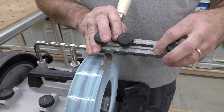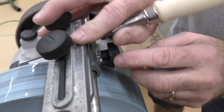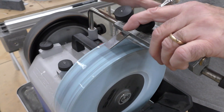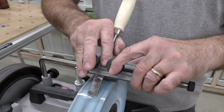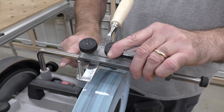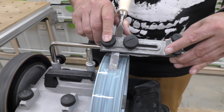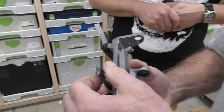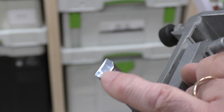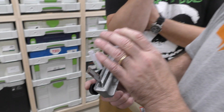Now this stone is rolling toward us and we are locked and loaded. Set it so it's right at the edge of the stone so you can use the whole stone back and forth. I like to just take my thumb like this and bring it right down — a little's a lot. It feels like silk when you're sharpening. We're almost there, Big D. This chisel was probably a little out of square — we got most of the bevel except for a couple spots. It's going to have a little bit of a hollow grind, but it's effortless. We'll have this in a nice mirror polish in just a couple more minutes.